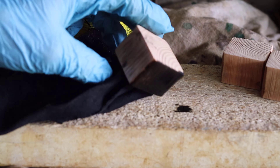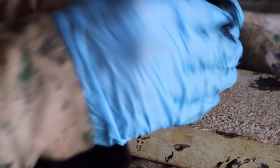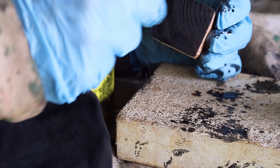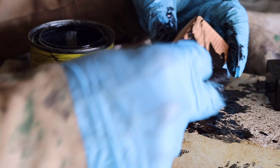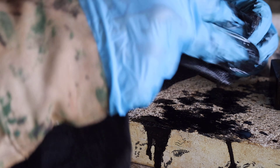As mentioned, I wanted to use these basic cuts to experiment with wood finishes. I figured since these are scrap wood pieces, I really had nothing to lose. I wanted to see how a dark wood stain would look, so I used a dark colored wood stain called ebony. Most of the time you apply wood stain, let it sit, then wipe off the stain after a certain amount of time. I wanted this really dark but liked that the stain still let you see some of the wood texture.